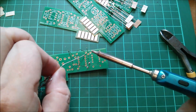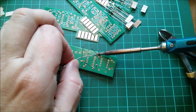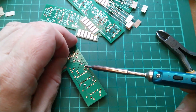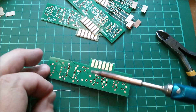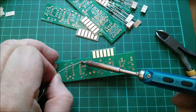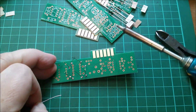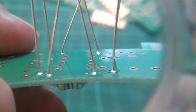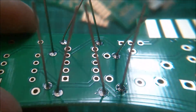How's it going to feel to solder the ENIG with my new minimal solder idea? The solder doesn't flow quite as well on ENIG - solder to gold doesn't take quite as well as solder onto solder, for obvious reasons. That one's gone a bit moundy. Yeah, it's just not quite as satisfying soldering onto this gold plate - takes a little bit more effort to get it to flow. They've mounded up a bit - let's have a close-up. I'm not really bothered, this is the conventional shape for a solder joint. It's just not my new low-profile eco solder joint which uses less solder.